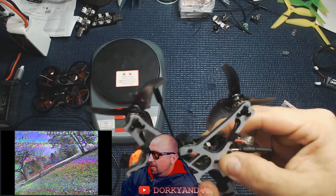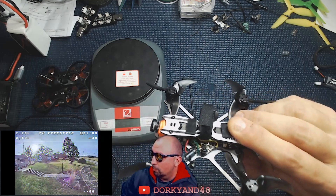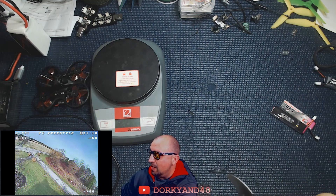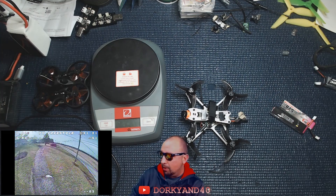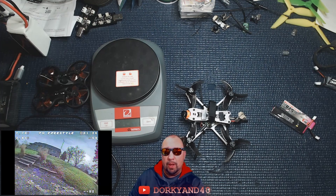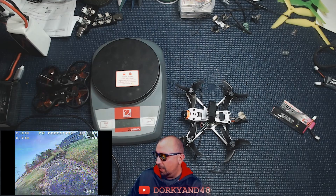I've made sure there's no compression or anything like that, so the flight controller board is free to move as it should. The Pro 32 is VHB'd really good down over the top of the gyro with two layers of VHB tape, so the gyro is not being influenced by any shaking or vibrations.